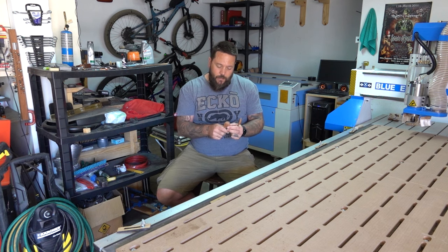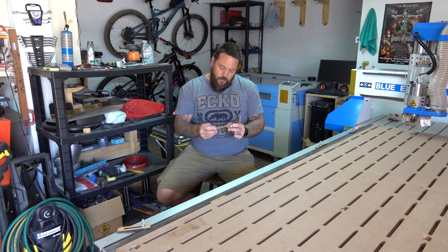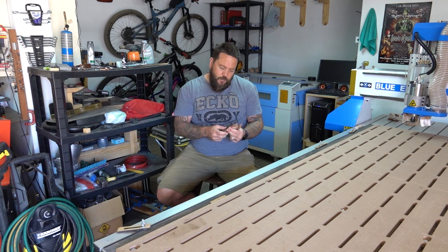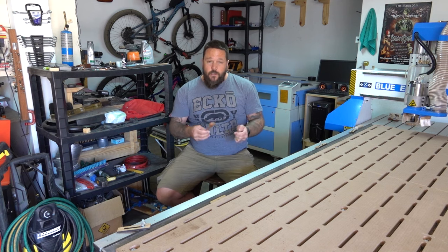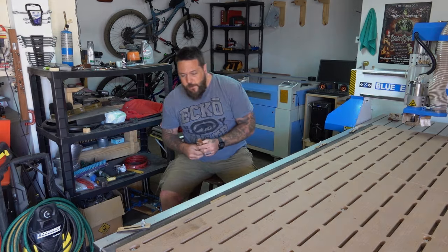I'm going to have to take out the belt sander anyway to clean up the tabs that are left behind. So while I'm busy doing that, I can just clean up those edges, and then with some hand sanding I'm gonna go over it probably up to maybe about a 600 or an 800 grit, and then they should be ready for finish. Although I do think before I put some finish on them, I may as well go ahead and engrave them, seeing as I have a laser machine. So let me go ahead and clean these up, and then we can engrave them.